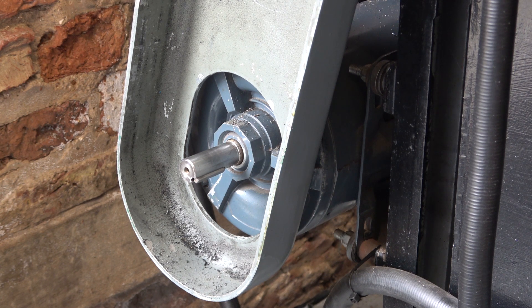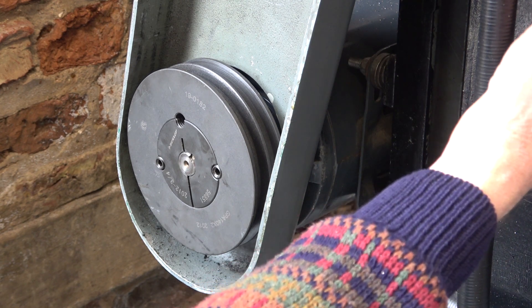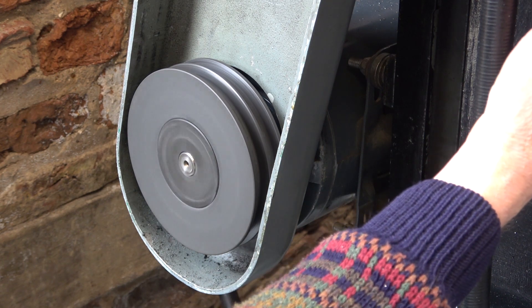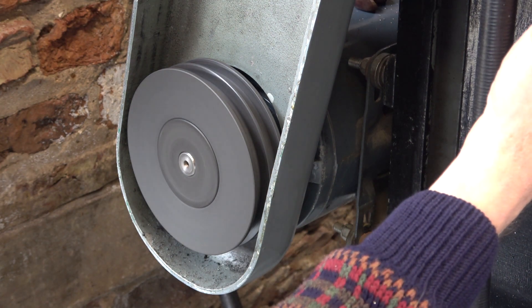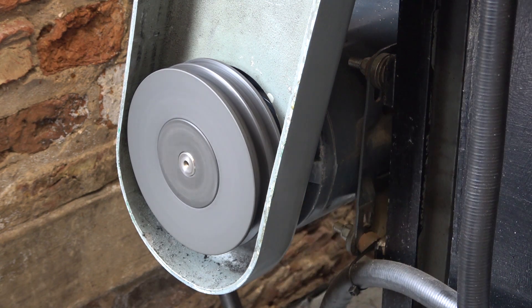What I am going to do is put the pulley back on the motor shaft. I've just slipped the belts off for a moment and run the motor to see if I feel any vibration as a final check. Put my thumb on the micro switch, start the motor, feel for vibration — nothing.